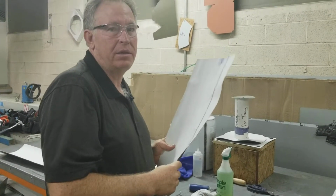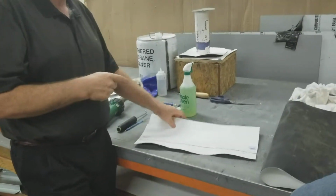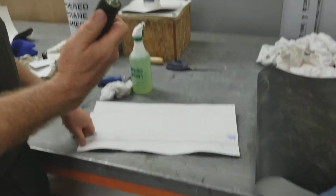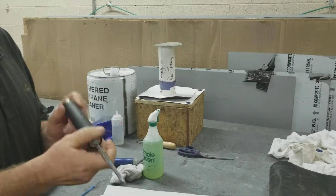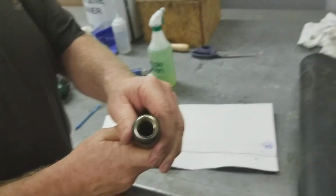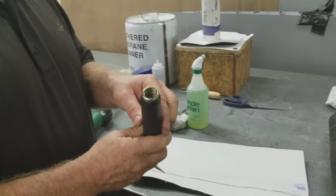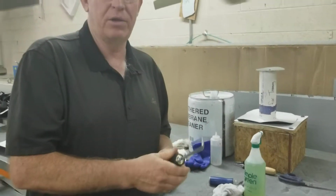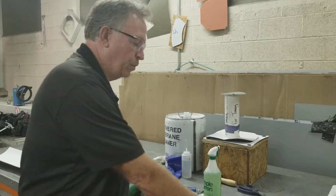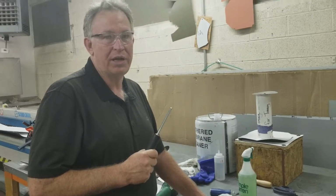I don't on this weld, and so I'm going to go ahead and probe this, and I'm going to pick on the weakest spot that I can find based on the lack of gloss. So we have an actual made-for probe. It was made for probing. It's got a threaded end, and you certainly want to have a stick on every single job, because you want to be able to quickly probe seams. And you put the stick on there and you can stand up and walk and probe this seam quickly, just to check to make sure that you don't have any leakers.